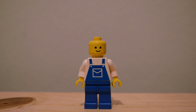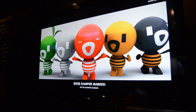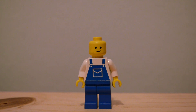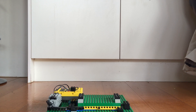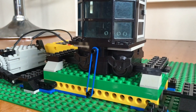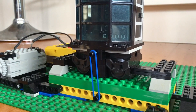Taipei 101 really loves its tuned mass damper. Instead of being hidden away, it's a tourist attraction, complete with questionably cute mascots. So why don't we build a rig that shows this technology in action? Step one: get a 1998 LEGO Mindstorms robotic kit. Now we have a fully functioning base isolation simulator. The motors shift the base back and forth, simulating earthquake movement. The wheels allow the building to move independently of the ground, and the rubber bands return it to its original position.